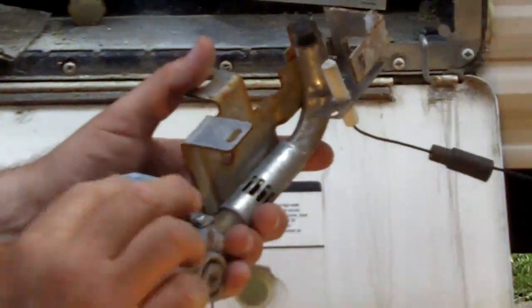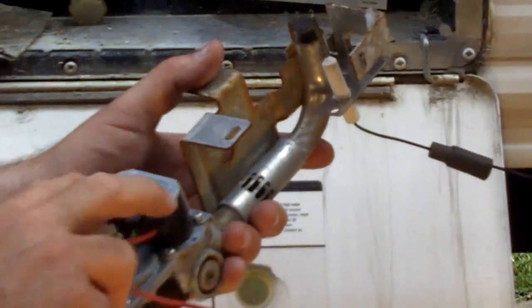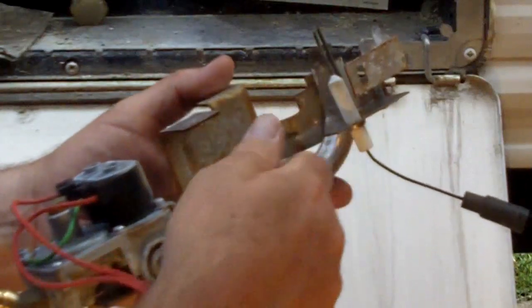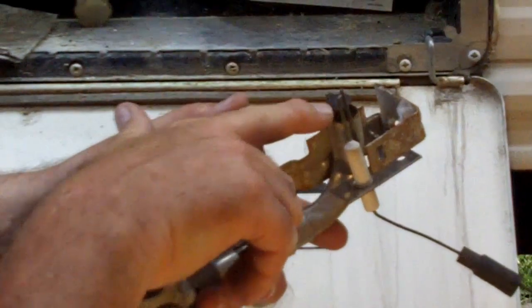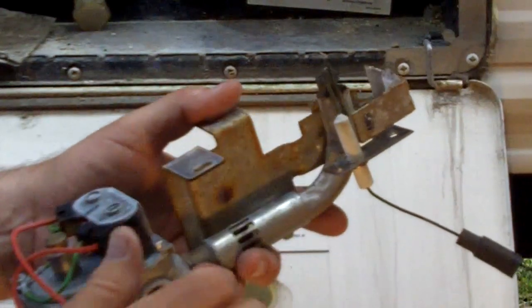The main thing is we want to check the coils and make sure that they're good. These coils for the gas valve — we're going to clean the burner tube and the gas tube here. This flame spreader, we want to clean that up, and we're also going to clean these electrodes up.